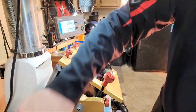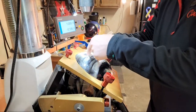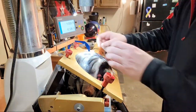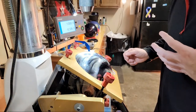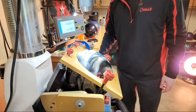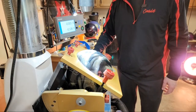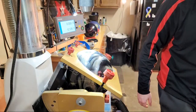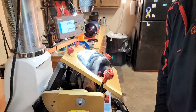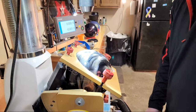All right, once again, this is much more desirable, having two separate holes as opposed to one larger hole, because any kind of separation that you can get between them definitely alleviates a large cracking risk, because the stuff gets hot when you mix it. Now the Thunder plug is by far and away the best stuff I've used. I think the Motiv HD is next, but it gets too hot, it cures too hard, more prone to cracking because it gets so hot. It gets hot, it expands, and as it cools, it hardens.